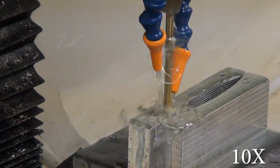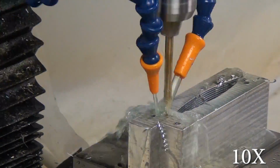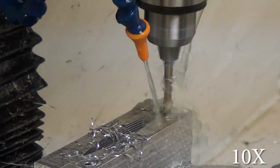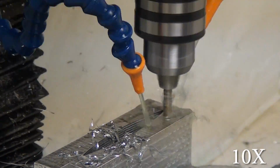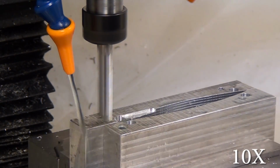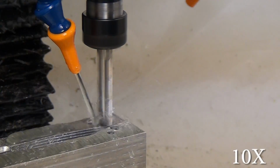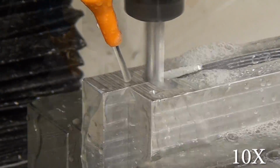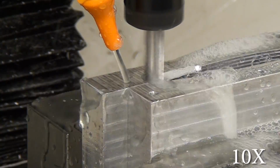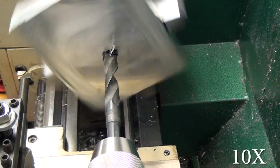Also, the slot in the top plate for tensioning the belt will be easier to machine, because I had to use a small 1/8" end mill, which you'll see here in a minute, and I machined it from both sides. If I could have used a larger end mill, I could have machined it all in one setup, and also the bolt head would have much more area to grip onto the plate within the slot. I hope any of that makes sense. Another thing is the way that I machined these 2 pockets you're seeing, which are for the bolts that actually bolt it to the mill head, and I changed that design a little bit in the final drawing as well.